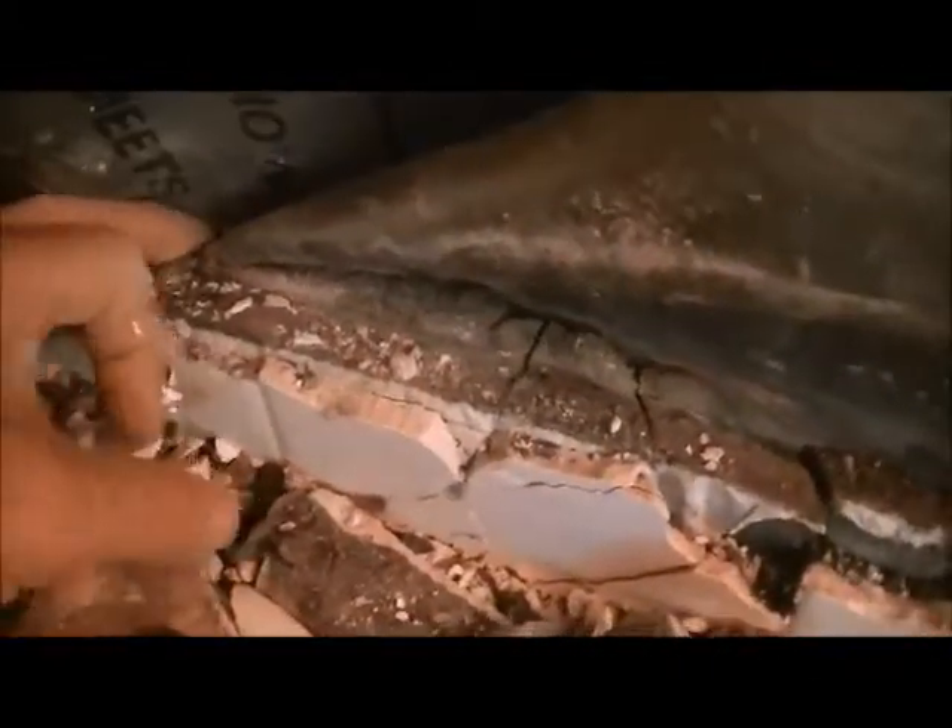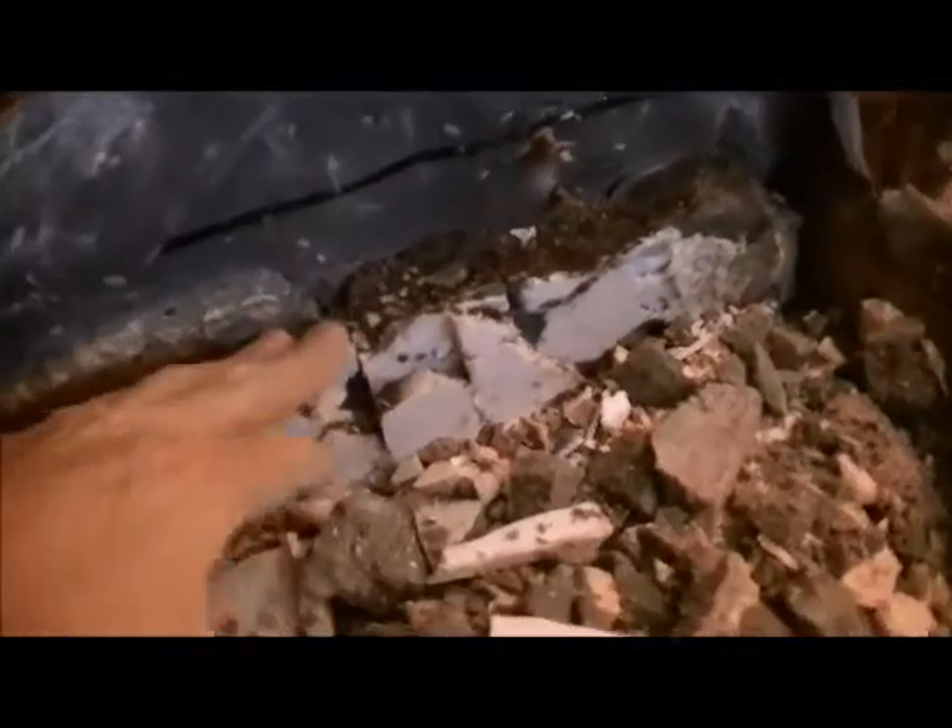The slope of this folded piece goes all the way down way back there — beyond where it's going to do any good — because now you have another fold allowing any moisture, which will go through to the bottom and out. Literally, if any moisture ever penetrates through here, you've got water issues. Because the pan was never folded and attached correctly, it's a big issue. All pans get moisture — it's not a matter of if, it's just a matter of how much, when, and how long over time it will destroy something.